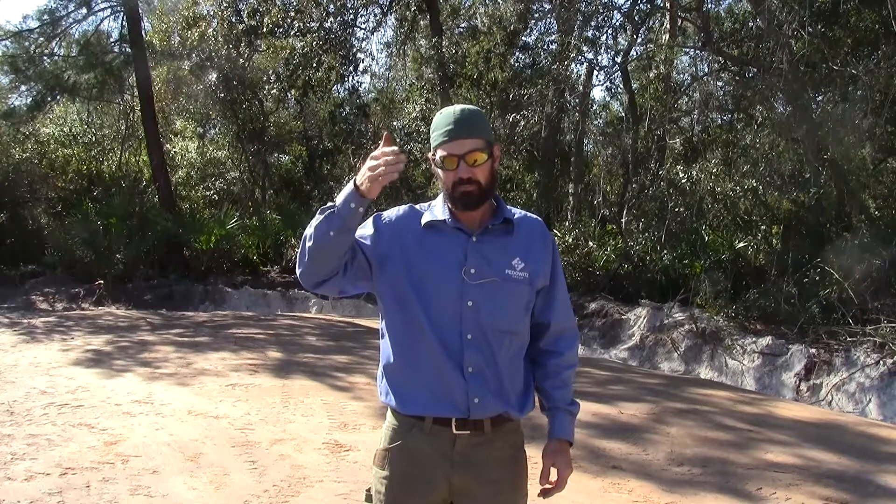What we're working on today - if you're wondering why the hat's on backwards, we're welding today. I'm going to weld up clips onto those joists. It's basically the same system that the house has - a series of square plates sitting on the joists, you weld it, then we'll end up screwing our joists and put purlins on top of those. It'll make a big grid system so the panels are oriented correctly - the front of the mill will be the gable end and it'll all slope single slope back, dumping the water off into the woods.